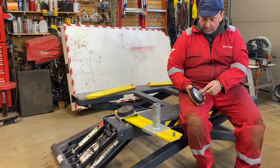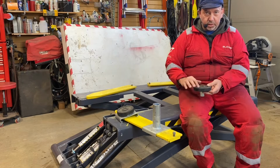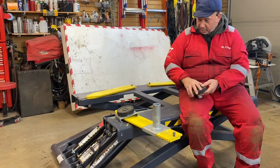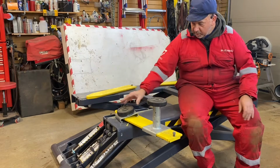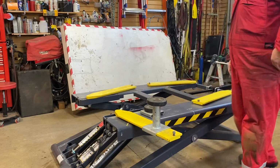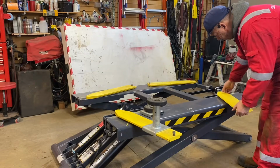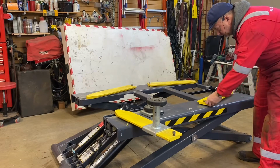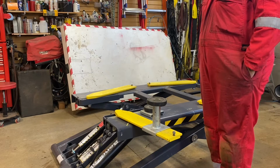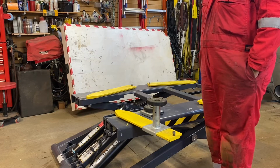I've seen these being tubular, with rubber pieces that, if you put it along the edge of the car on the pinch points, you'll see it actually pushing into the rubber and degrading the rubber after a while. These, not a problem. So that's this side of it. Each one's exactly the same. You can position it backwards and forwards as normal. The actual lift is probably just over 900 pounds. That's 450 kilos or thereabouts. So she's fairly heavy.